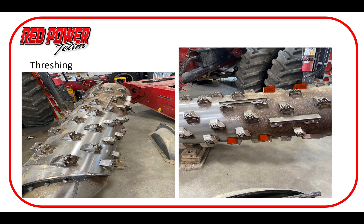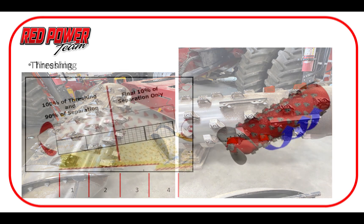Now we're looking at the rotor. We've gone over that in detail before, but one point I still want to make is to ensure that for corn and soybean country you have at least four straight bars on this rotor, as we've indicated in some of the other videos.